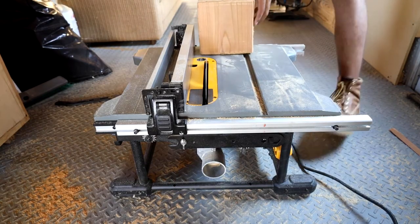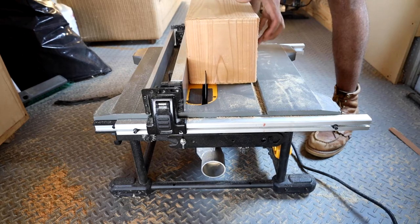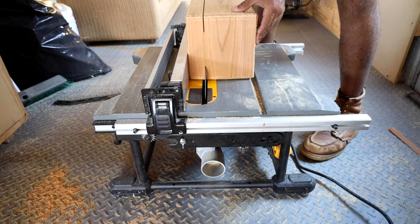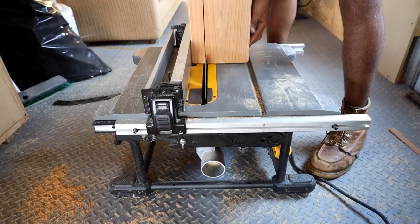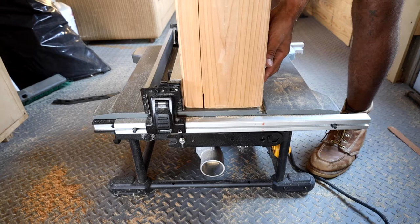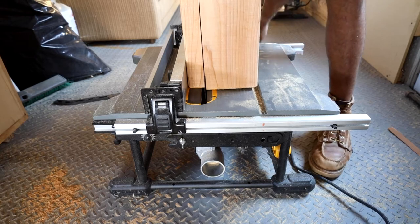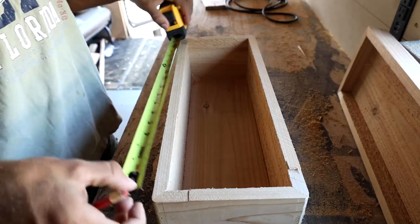I had only just recently learned that when you make a box you don't make the bottom and lid separately — you make the entire box and then run it through the table saw and cut the ratio you want from top to bottom. I did an inch and a half to two inches for the lid, and that worked fine. But somewhere along the line something shifted and the blade moved to the right about a blade's width. It's not a big deal but I really didn't like that. There's the bottom and the top, and I'm happy with how it came out.